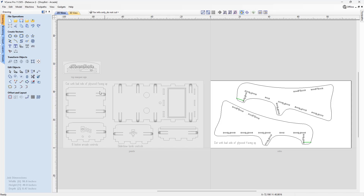We've got two files included: ShopBot's — that's Bill's original arcade file included as part of the free files — along with the Vetric version which has slight tweaks. Opening ShopBot's arcade file in VCarve, we are working with full 4x8 sheets. The material thickness for this file is 0.47 inches, which is pretty standard from most plywood suppliers.